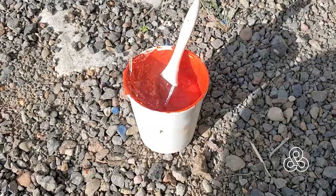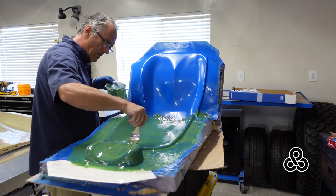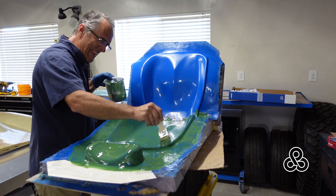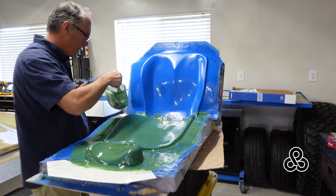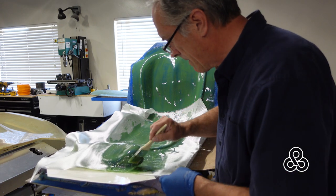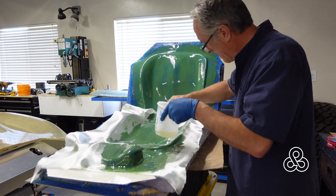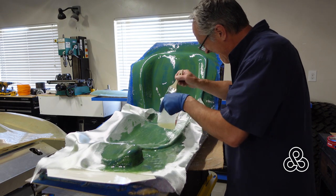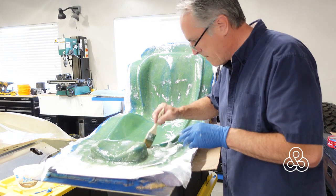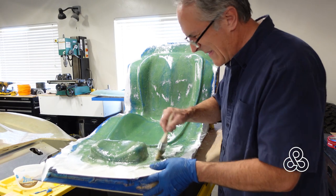So I sanded all that down, put another coat of blue paint on it, and then switched over to my typical scenario: wax the mold, PVA, and then go to epoxy instead of polyester. So here putting the epoxy gel coat on. Once you get the gel coat on, start building the mold — we're going to put three layers of fiberglass cloth and then switch over and use polyester to back the whole thing up, because it's a little less expensive. We're working this on the three coats of fiberglass cloth. The gel coat's just getting a little thick, and so we're able to work our fiberglass into that gel coat and press it into all the nooks and crannies.